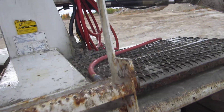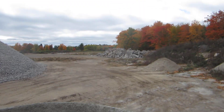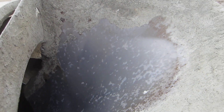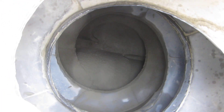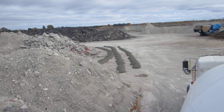Now I'm going to show you the inside of the drum. Climb up the ladder — always three points of contact. This is the hopper; this is where the product gets loaded into the barrel. And if you look down in here, you can see the barrel and the concrete down there. I'm going to blow all that concrete up — it's going to come out here, down the chute, and I'm going to make what we call windrows. You know those windrows there? The dark gray ones.